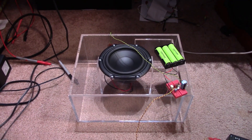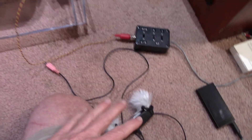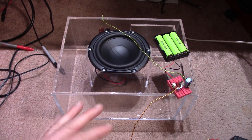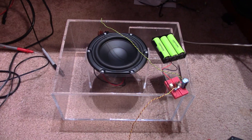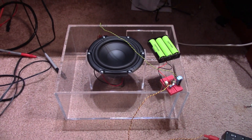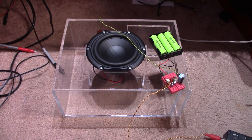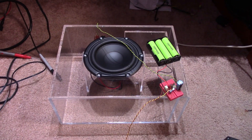There are the recording samples. I do apologize — you can hear some pops in a couple places in the playback because with that hypersensitive mic I clipped the sound recorder. What do I think of the thing? Pretty much what I expected. It's not really sensitive, but it does deliver decent bass. It doesn't dig really deep, but you get pretty good low bass — in the playback of the 30 Hz tone I could hear a little port turbulence. Overall it does kind of have that ported sound to it. It doesn't have any stuffing inside — it's kind of form over function with a clear acrylic box. It works pretty well. I'm going to hook it up to an amplifier that can deliver more power and see what it sounds like.